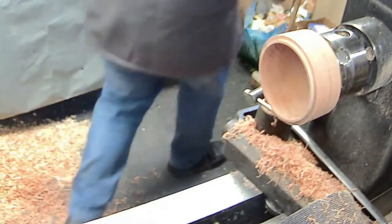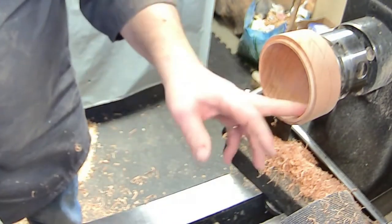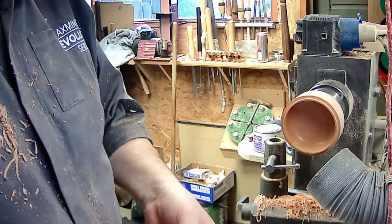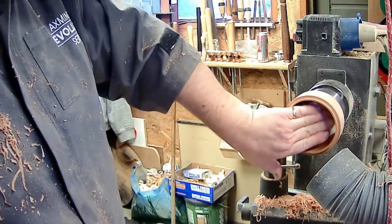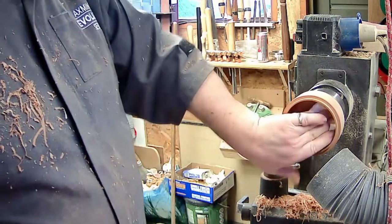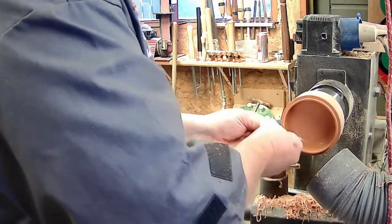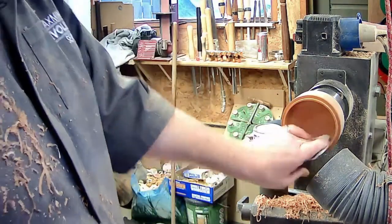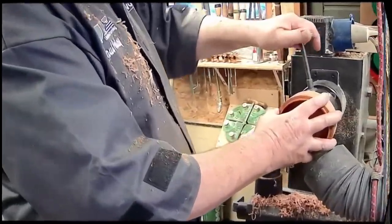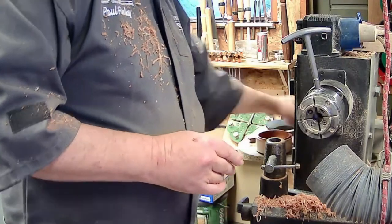Right, that's ready for sanding. I won't be boring you with the sanding process. We'll be starting at 120 and going up to 400. And we use the Yorkshire grit - it takes any wee fine lines the last sandpaper left. Yorkshire grit is an abrasive so it won't take deep scratches out, but it will take wee fine scratches. Nice piece of cherry is what it is. So we'll set that over there and we'll get our lid on.